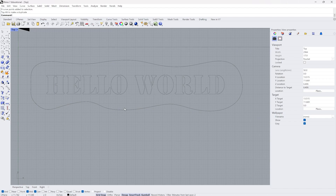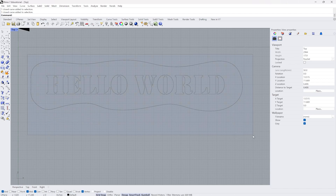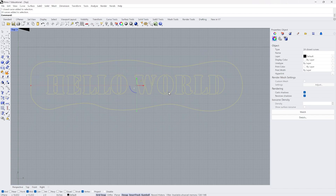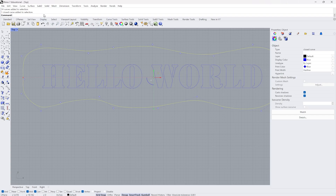Once I've got that all set I could select each item individually using shift-click, but better would be to simply left-click and drag a box over everything on screen. I want to color code these so that the laser cutter sees them as something we're going to cut. I'm going to set the display color to blue, the print color to blue — that's what the printer sees — and the print width is going to be set to hairline. That is everything I need for the laser cutter to see these as lines to cut, assuming I set blue to a power and speed appropriate for cutting.